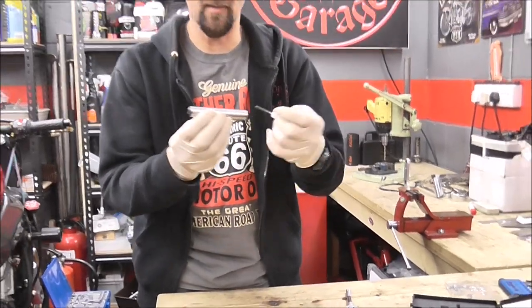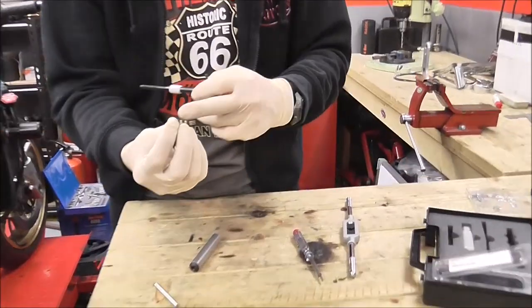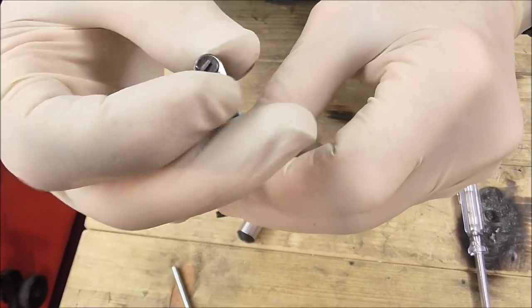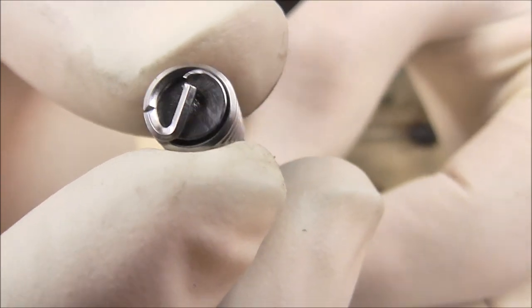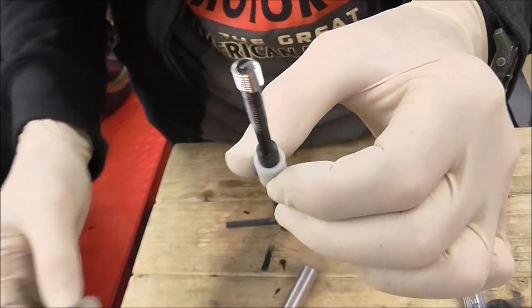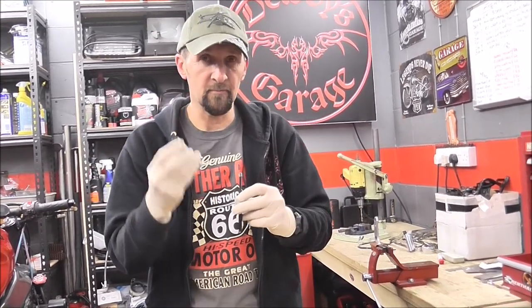So you've got a little applicator tool. These can take many forms — there's a bigger, thicker plastic one. But basically you have an inner and an outer; one goes to the side of the other. You put the repair thread and screw it on the end of the applicator like that, all the way on. Because this is the size of the bolt you're going to be using afterwards. You can see the little shoulder on the end of this applicator tool — as it comes round it grabs that piece and turns it. Now you could argue, why can't I just insert it by hand? Well, you could, but because you're pulling on that centre piece it just coils it up and stretches the coil. You need to hold it on the outside as well as the inside while you insert it into the repaired hole — and that's what this tool is for.